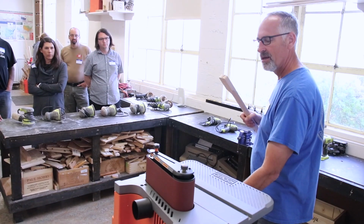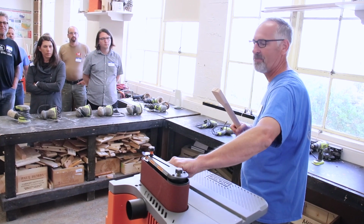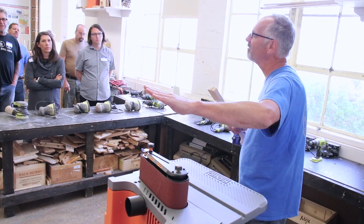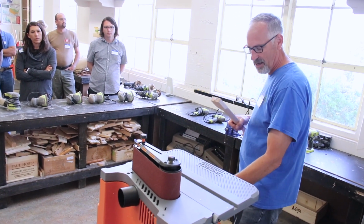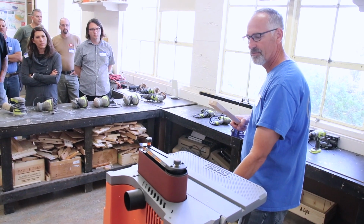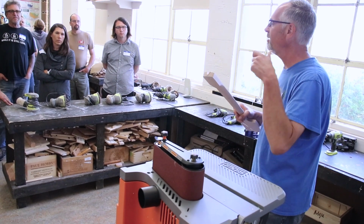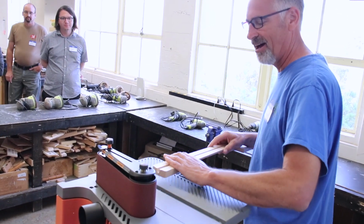You got it. On this belt sander, if you start to see the belt creeping up or creeping down, there's a little knob here with a plus and a minus on it, right? So you can turn that to fine tune and get that thing to set where you want it to be. So it's just on and off right here. Safety, right? So we've got something that's rotating that could easily grab jewelry, ponytails, hoodie strings. I'm going to go ahead and turn that on.